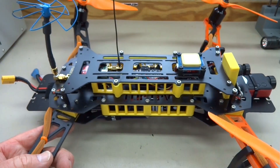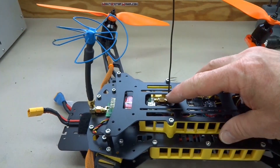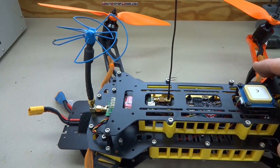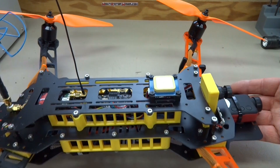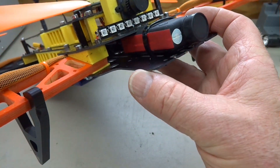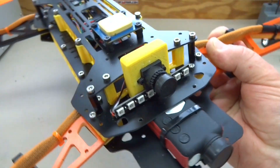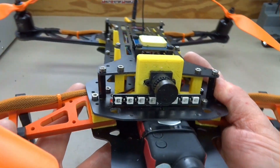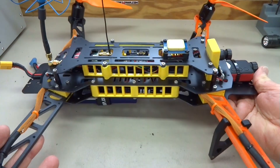Here's what we ended up with after a little trial and error. On the second deck I went ahead and put the second set of gills in — looks kind of neat. I stacked my receiver on top of my transmitter so the two antennas aren't side by side — spaces them out and gives me more room inside. The GPS is tacked up here with non-metallic standoffs. On the front I slid in my Mobius — it's a perfect fit between the two decks, zip-tied anyway, with the power button easily accessible on the front. On the front of the camera I hot-glued the NeoPixel bling to freak out passers-by and let quads we're chasing see flashing lights in their rearview. Let's see if we can take this out and make it fly.